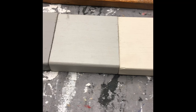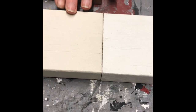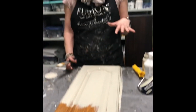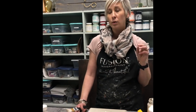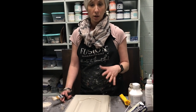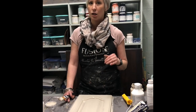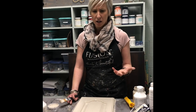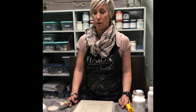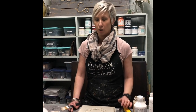Raw Silk is a really popular cream — it's sort of a farmhouse white, not too yellow, just a little bit of ivory. And then our classic white is always a great choice for kitchens. With white, because there's zero color pigmentation in it, you will definitely need two coats, and in some cases three coats. When you're covering oak, it has a really strong grain, so oftentimes it's going to take three coats — the odd time four coats — to cover that grain, because it comes through lighter colors like white. So if you do choose white, you may need to do a third coat to get really good solid coverage.